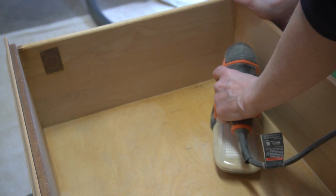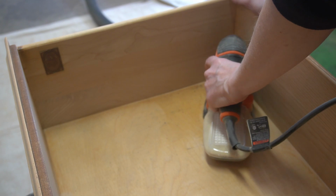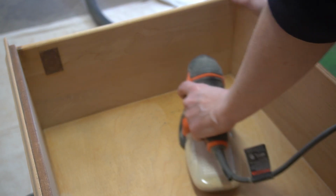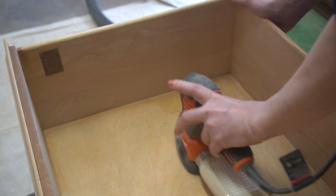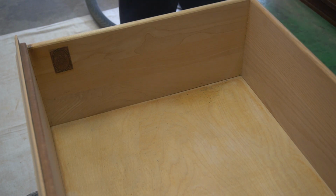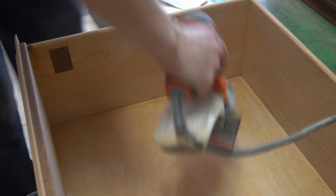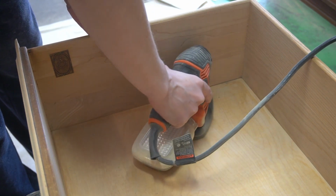Each of the drawers had some various markings, plus most had yellowed some over time. I used my newly acquired Black & Decker mouse sander with a 240 grit and I smoothed over the base and all four sides on the inside. I love this sander for getting into corners and along smaller edges. I wiped down the dust and left them to dry.